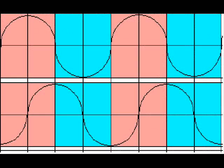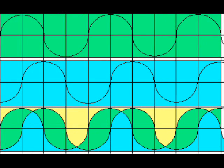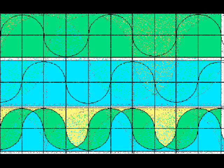Here we show two sine waves: one for the outer coil and one for the inner coil. Notice they are 90 degrees out of phase. Notice the red and the blue — the red represents north and the blue represents south. There's 180 degrees, and basically this is how the magnets affect the sine wave. You could look at the magnets and say they're over these coils right there. The top sine wave is the outer one and the blue one is the inner one, and we put these two together.